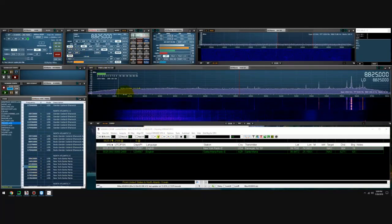Right off the bat, the noise floor — at some points it's at negative 115, negative 117, 118. I believe the W6LVP loop was in between negative 100 and negative 110. So there's a noise floor difference there, and it's nice and linear — linear meaning it's not all over the place. I'm not getting humps; it seems really well-behaved.